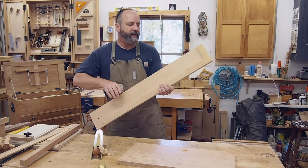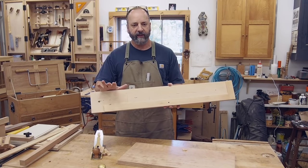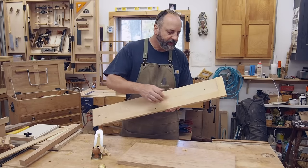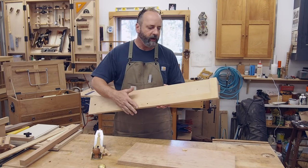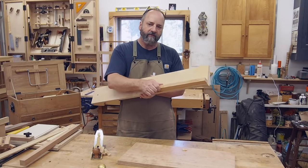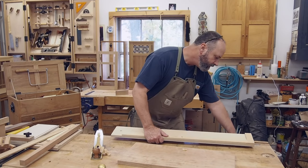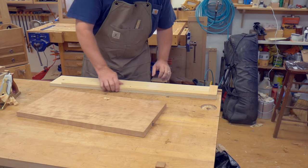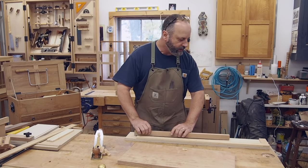This jig is a little bit more involved but not a whole lot more. There's a plywood base, there's an end stop, and in addition there's a strip along the length which gives me a side stop as well. On the bottom I have a little fin which clamps into my front vice to hold everything in place.